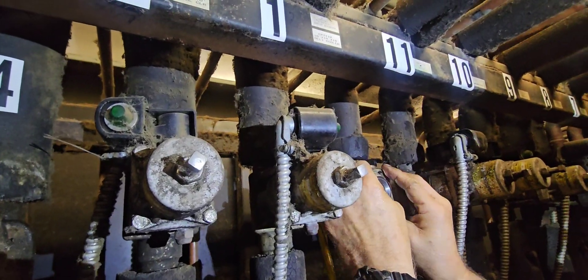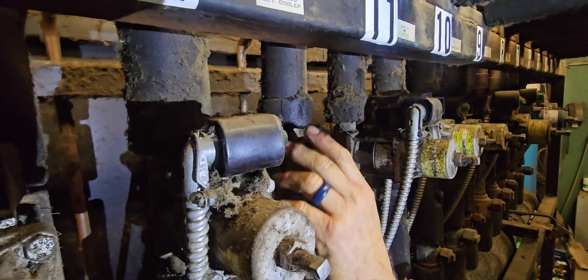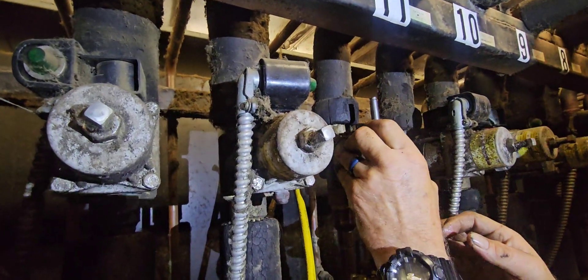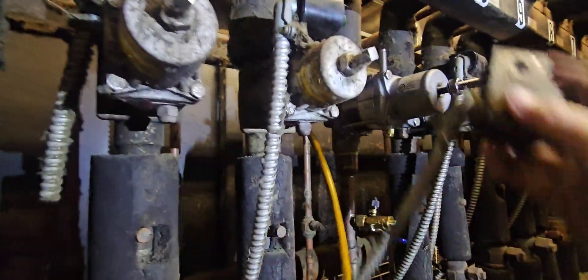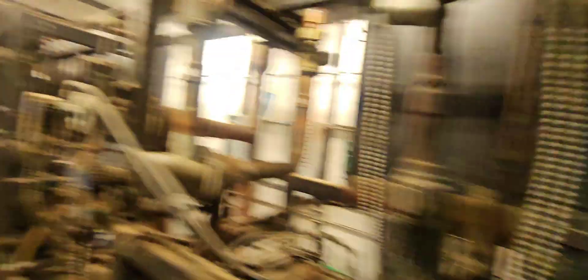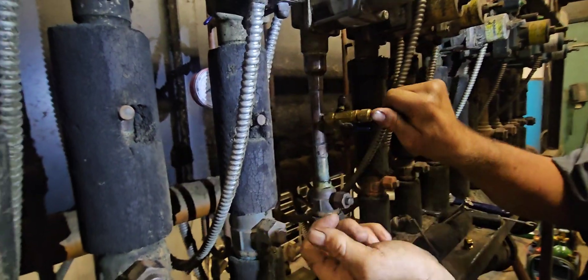Careful of that O-ring. We've got this thing back on. We'll go ahead and energize that solenoid, do a purge from the suction through the liquid, and do a quick leak check. Remember — always with the new strainers: every time you take a strainer out, put a new one back in. It's just cheap insurance.